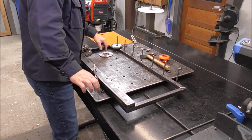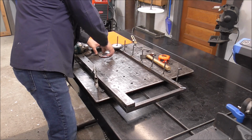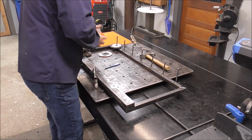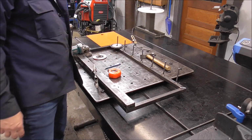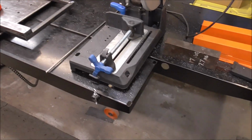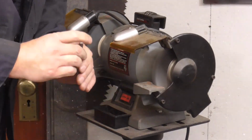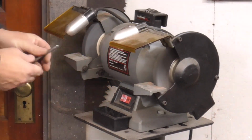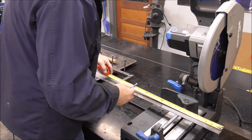And I'll probably space them out, so 1, 2, 3, 4, 5, 6, so that they're in between these ones like this. So my piece of flat bar is going to be cut to fit inside this. It's 34, so one piece at 34, and I'll have to cut 6 more of these dowels. So let's do the dowels right now since we're set up. And we said we were going to cut this to 34.